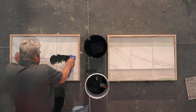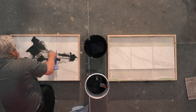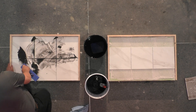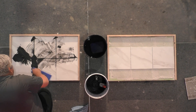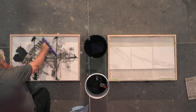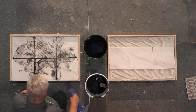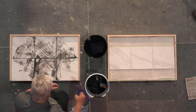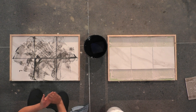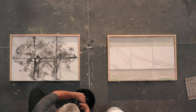Vivid also has a wide water range — 2.3 to 2.6 quarts of water per 25-pound bag — which is extremely wide for a high-performance cement-based grout. Many grout manufacturers call out a very specific water range and state you have to stick to that mixture for successful application, color consistency, and ease of use. With Vivid, you can mix it a little looser for a floor application or tighter for a wall application where you want less sag. A fiber is also built into Vivid, offering flexibility, sag resistance in vertical applications, and flexibility after cure.